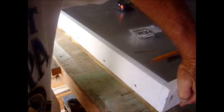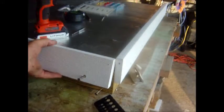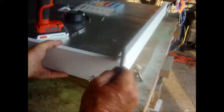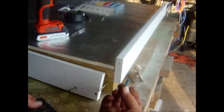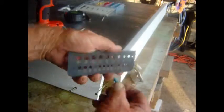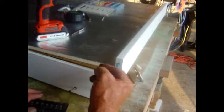Then we're going to come to the front and the back — same thing, cut a board that fits, do the same thing down here, prop the board up and screw it on. There will also be some screwing together of this board onto here. I've cut the sides, put them on, and drilled a 7/64 inch hole through. For the PVC board joint — you can screw through it but the screws don't really bite down — so to fasten PVC to PVC I'm going to use these simple plastic wall anchors. This one particularly matches a 7/32nd hole, and I'll put this in with some glue.